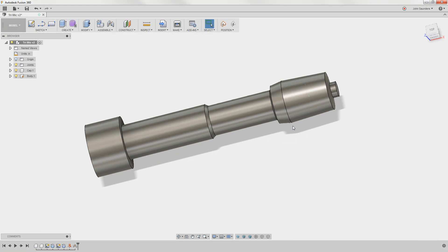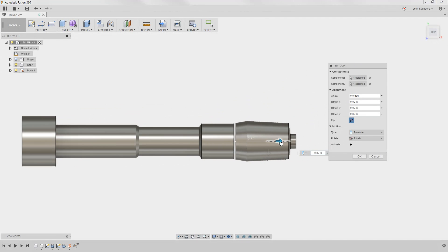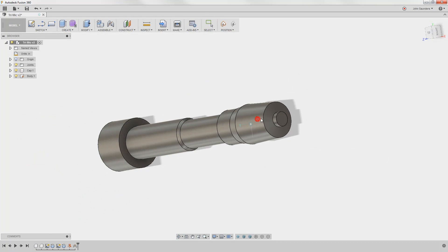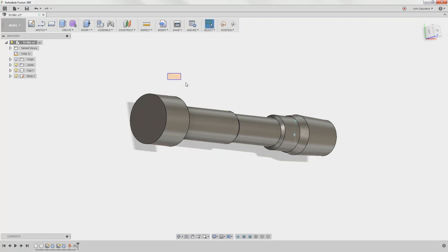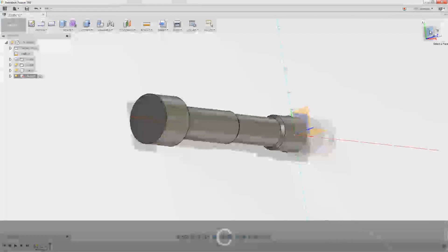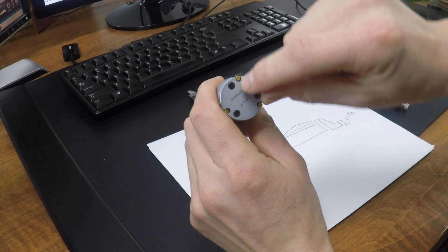The way we modeled this, it's supposed to be exposed — I did a joint with that cavity inside, so we'll fix it in more detail next week. For now, right-click on this joint, edit joint, and I'll drag the cap off so it's something like this. Click OK. Now you can see we've got a cap where we can turn the handle. Let's go back to the body, activate it. C for circle. Look at it from a left view — let's add these lobes with a cutaway.